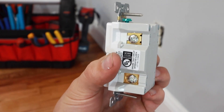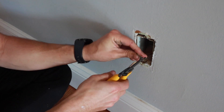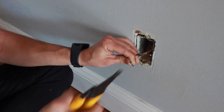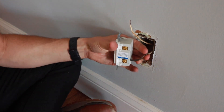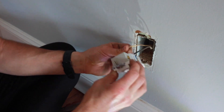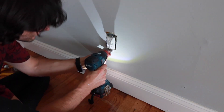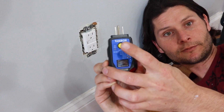Now the upgrade — let's replace the old outlet with the new GFCI. Grab your wire strippers and strip about a half inch of outer sheathing off the white and black wires. If you have a ground wire, there's a green screw at the bottom of the GFCI — twist the ground wire around that. Then insert the black and white wires into the back of the GFCI on the line side, black with bronze, white with silver screws. Grab your drill and screw it in tight.